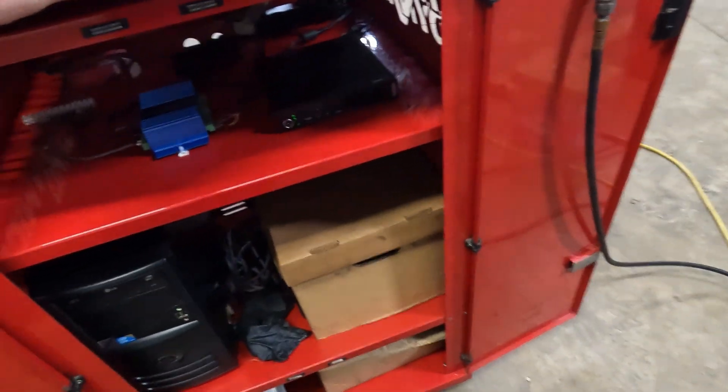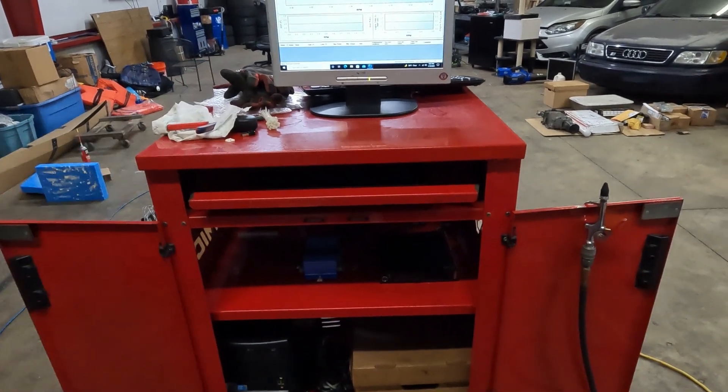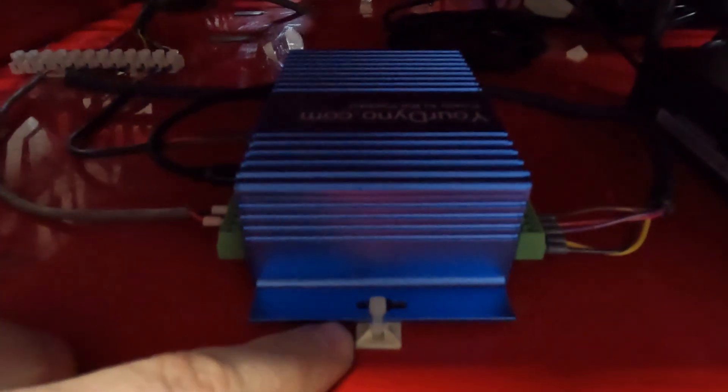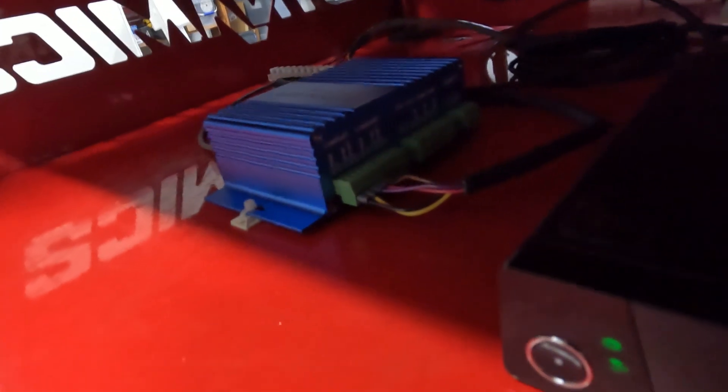Onto the cabinet — reusing the old cabinet. Here's the old cabinet. I'm going to be changing the monitor but this is what's on there for now. This is really the heart of it, this is all there is to it. I still have to mount in the back of the cabinet — the control cable is just kind of hanging out there. I have the control cable here; this was solder cup unfortunately but such is life. It comes into a terminal strip with these little zip-tie sticky mounts for now, which holds everything in place but still looks pretty good. I have a terminal strip there, and then we have our PWM, our USB cable, our RPM input, and on this side of the box we have our load cell right here.